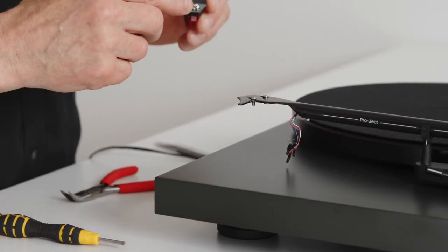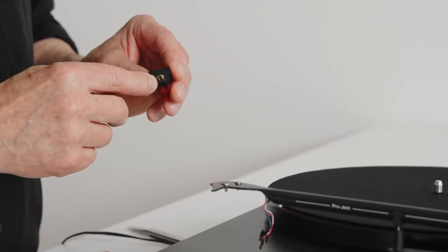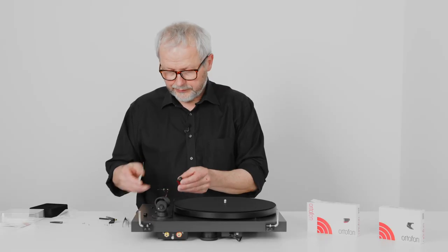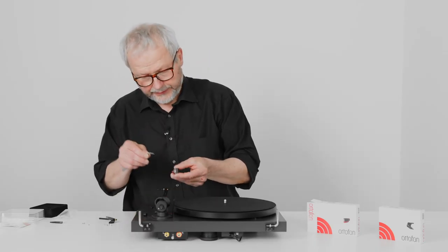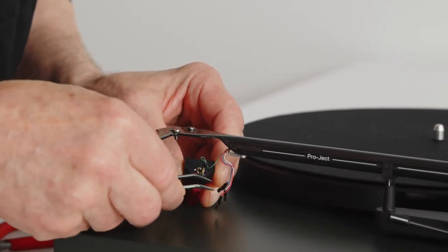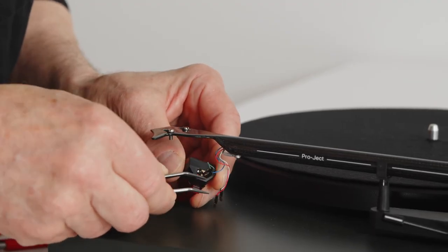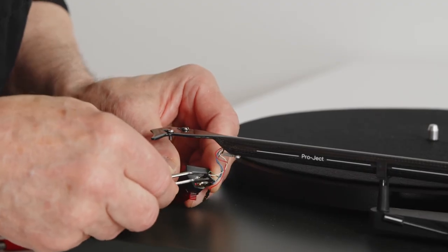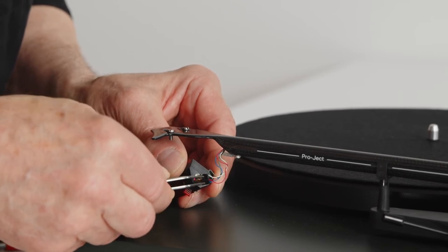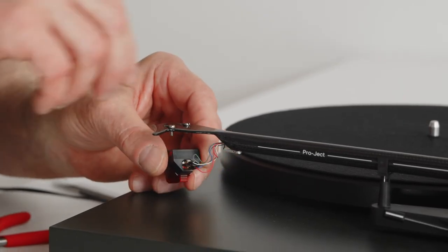At the back end, as I told you, we have this color coding — red, white, blue, and green. The green is covered by a ground connection, but you have the color coding. So now it's just a question about taking the wires and connecting them. I prefer tweezers — you could use other tools. Again, don't hold on the wire itself; it's very thin and very fragile, and if the turntable is old it might be even more fragile. So be careful, never on the wire. That easy for the wires.